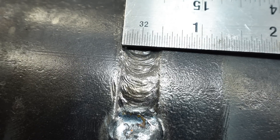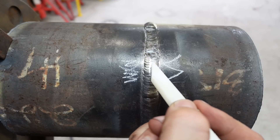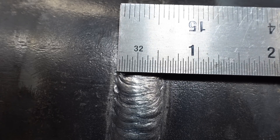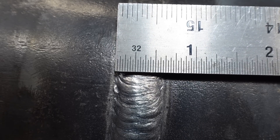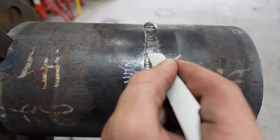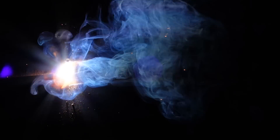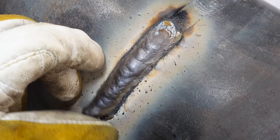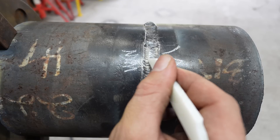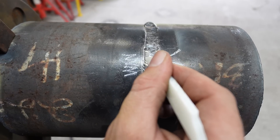These bevels are only about a half an inch wide. We're about a 16th outside that half inch, so that means we're at about 9/16ths from side to side outside — that's as much as we get. We can't aim for these bevel edges; we've got to keep that rod still inside those bevel edges. We might just pause a little longer to let things fill up. You don't see that z-pattern in my weld — if you look closely you can see how those ripples stack in there. We're staying in our puddle, inside the bevels, all the way up.